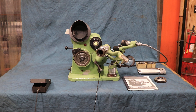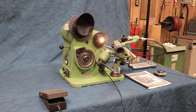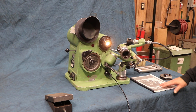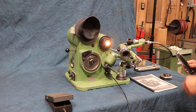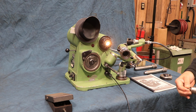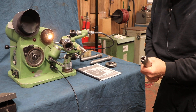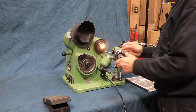You inspect your drill by putting it up against this lens here, which is calculated to give you the best focal point — you actually put your tool right up on there. These tools slide into the head here and hold the drill; there's a smaller size and a larger size. The drill goes in, you tighten it up, and then it goes inside this collet or sleeve which has a collet on the back of it.